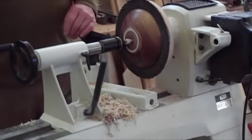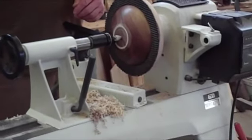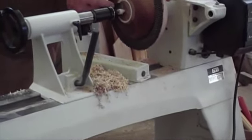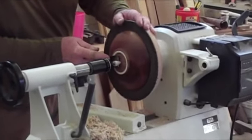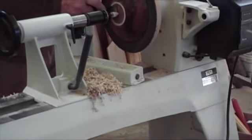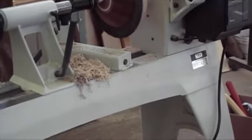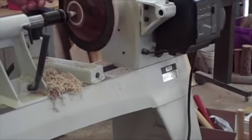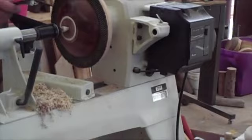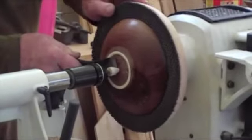Needless to say, these chisels are sharp as a razor. So you take this — you can buy one for about $20 — set it in here. Now do not, trust me, do not turn the machine on to do that. I've never tried it, but I have bad visions of it. The problem is when you take that spoon, especially if you've got something with the grain going this way, if you snap it off or try to cut it, a lot of times it'll pull a big chunk out of there and you've got a funnel instead of a bowl — you can see right through it. I've had really good luck using this technique.